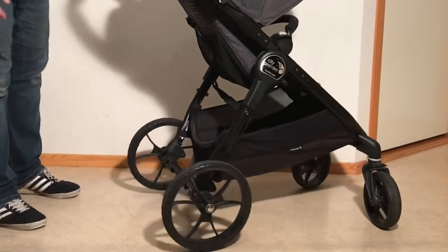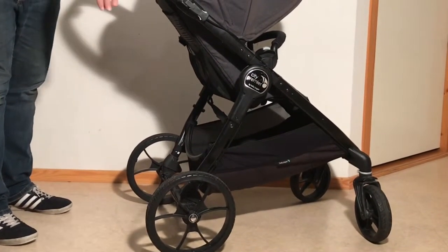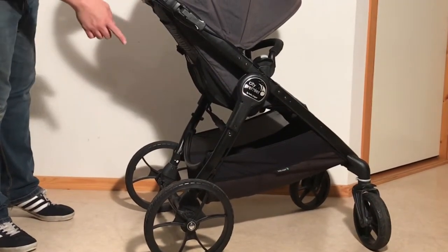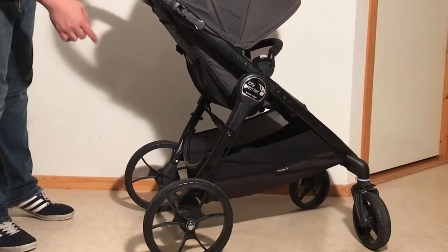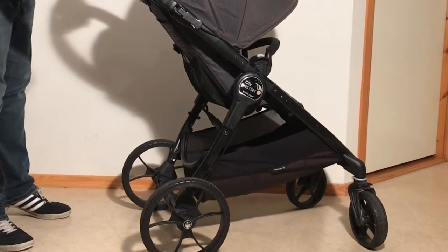If you're having any problems with the brakes — the most common being that the pin does not retract entirely, thus causing a rattling sound as the pin comes into contact and actually does damage to the brake disc on the wheel — or that one wheel won't brake or one wheel won't release.